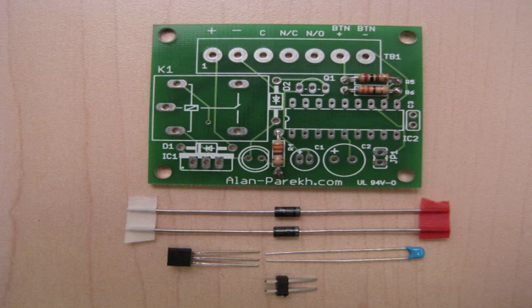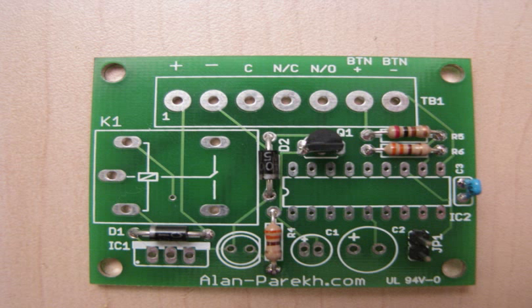After that we're going to be looking for two diodes which are on the top. On the left hand side there's a three-legged transistor, a blue capacitor and a pin header, and those get mounted as shown here. Please note that the diodes and the transistor are polarity sensitive.